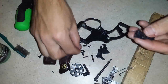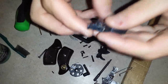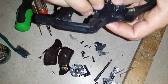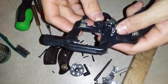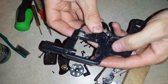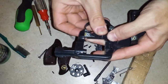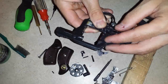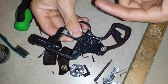Now to put it all back together. Take that hand spring and put it back where it goes. Work that trigger spring up there over that pin — I'm going to start down low and push up. Make sure this safety spring is to the back, just like that. Make sure there's tension on the trigger and the spring is working. Safety spring is going to stay up. The trigger spring is continuously trying to push the trigger back out — keep that in mind.